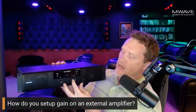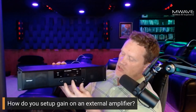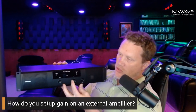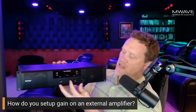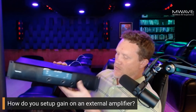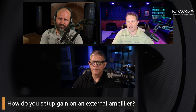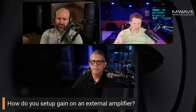I can't tell you how many times I've read that someone couldn't get their signal low enough because they wanted full advantage of the amp's power, so they had the gain attenuator knobs all the way up. That's a misnomer — you are not losing full power if you're not at maximum on the attenuator knob. There's a lot of confusion on the whole thing.